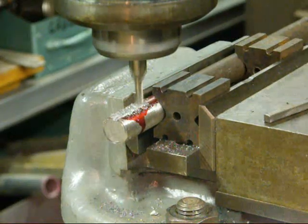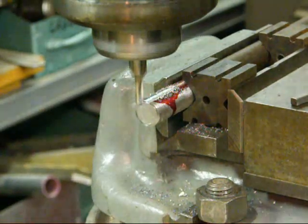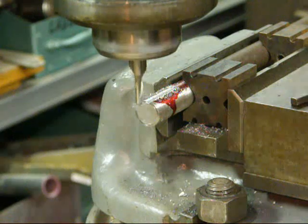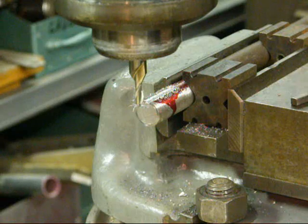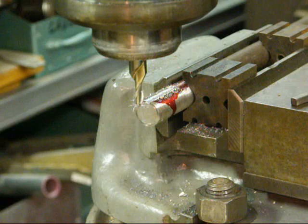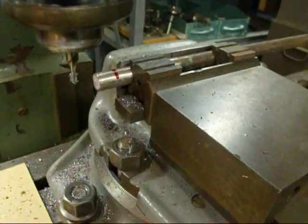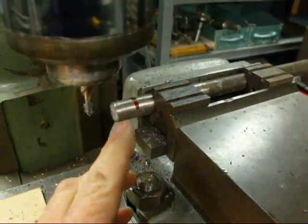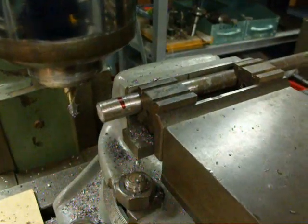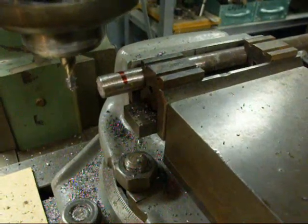Alright, I'm up to my layout line. I'll back it off. In the next few passes I'm going to use oil and go in about 25 thousandths each pass, and on the very final pass I'll just take off about 10 thousandths. I'll meet you at that last pass. I'm also going to show you some still pictures where I drew a diagram of why we need to find the center of the work, because otherwise your keyway will be offset — a good picture and a bad picture to show you why.